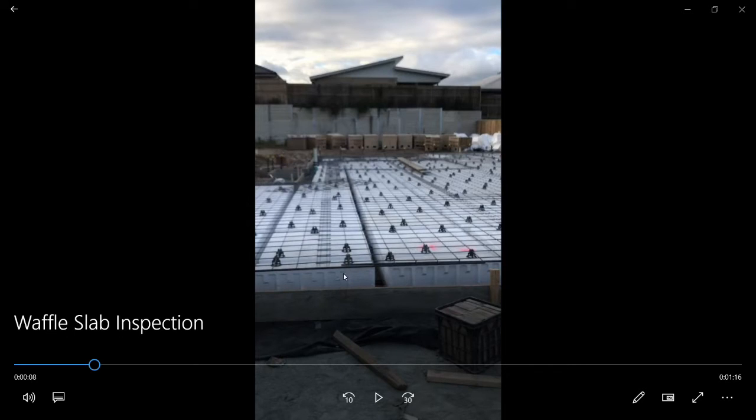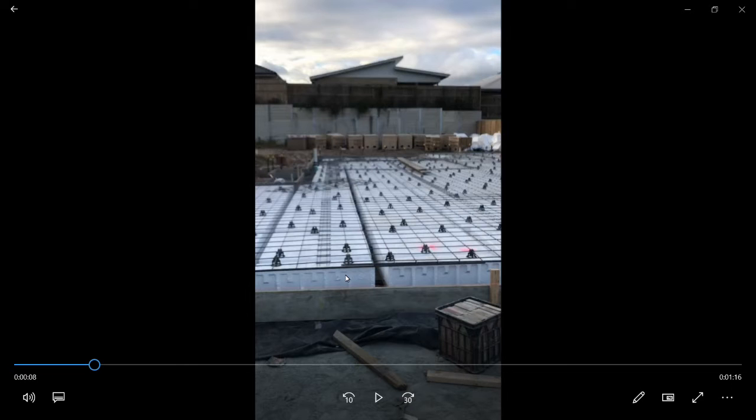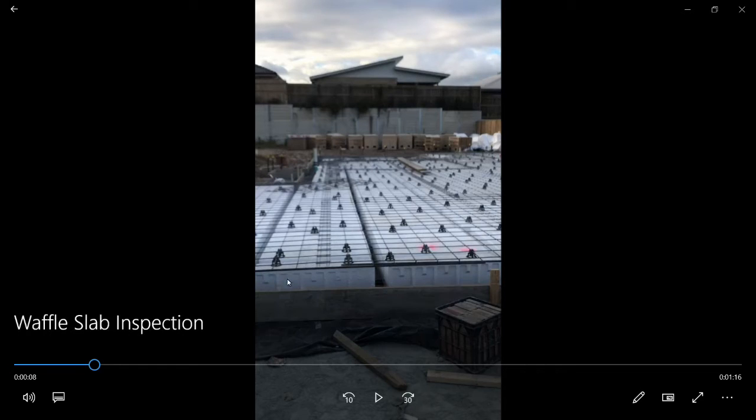The white things that you can see are the polystyrene waffle pods. They come in about a metre by metre squares. They're semi-hollow underneath — not like solid polystyrene — but on top they're solid. The space between the waffle pods is about 110mm wide. These are the ribs of the waffle. When this concrete slab gets poured, this space will become concrete. The top of the waffle pods will be covered in concrete, and that's the strength of these beams or ribs that occur at about a one metre centre.